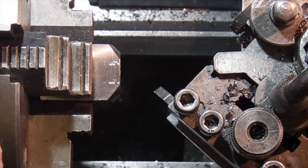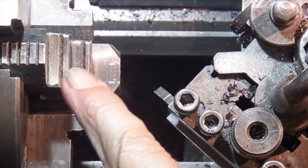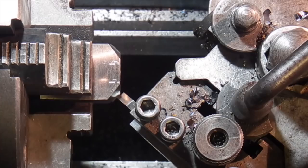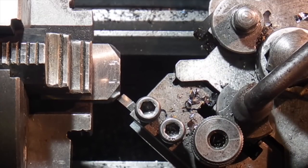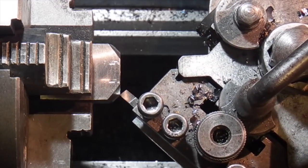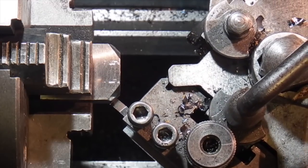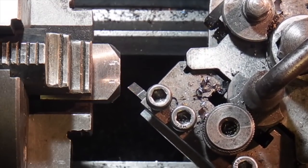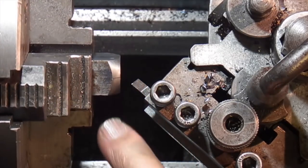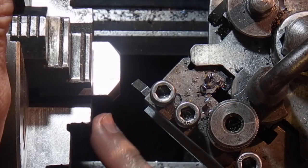Set this square by using the jaw just to look. And I want to put a scratch mark that you see there, the mark. If it's out of line or it doesn't look right, you can always machine a bit more off the taper